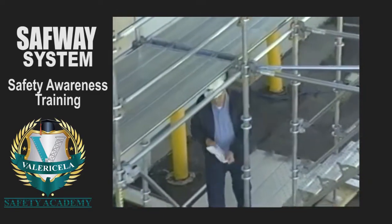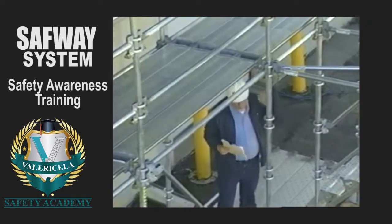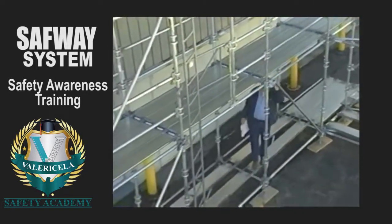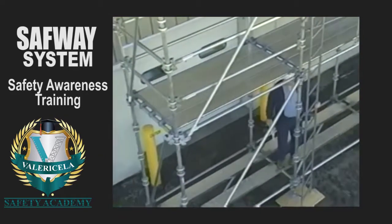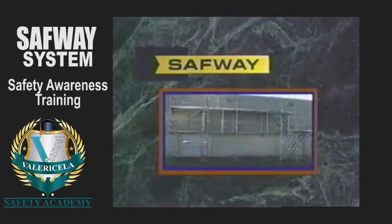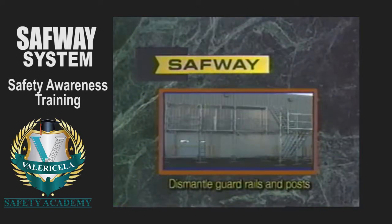Prior to dismantling, a thorough inspection of the entire structure must be made to ensure that it is safe to dismantle. You may need to add parts or increase the base width of the scaffold, for instance, to stabilize the scaffold if ties were removed by the user, or to correct any unsafe condition before tearing the scaffold down. To begin dismantling, the upper level guardrail and posts are taken off.